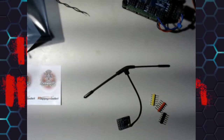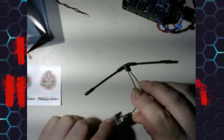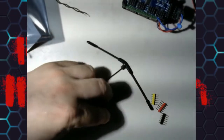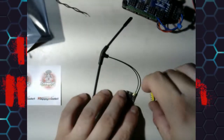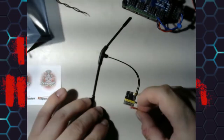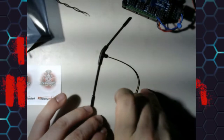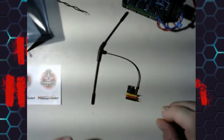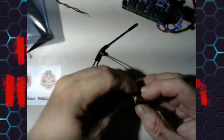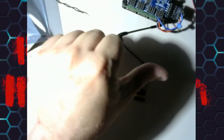This is the second one of these I've gotten, and yeah, it is how I remember it. So basically, the PWM is the row closest, the power is the row in the middle, and the negatives are the row on the bottom. And they are also labeled on the back. So 6 is the one on this side, and 1 is the one on that side.